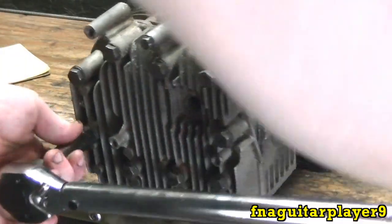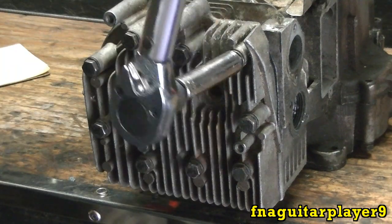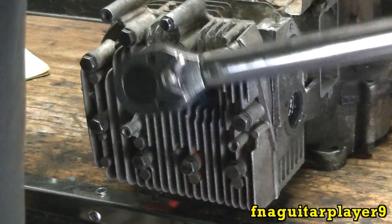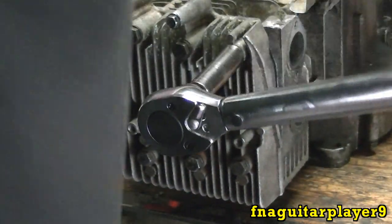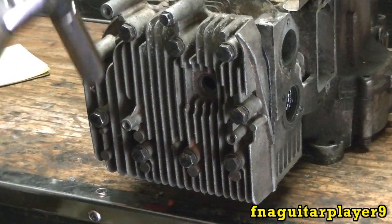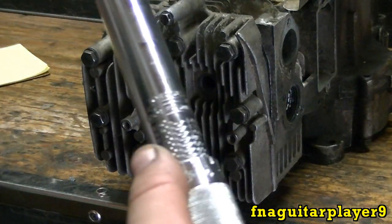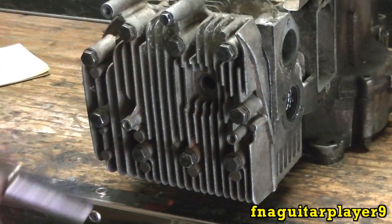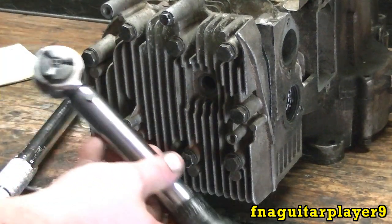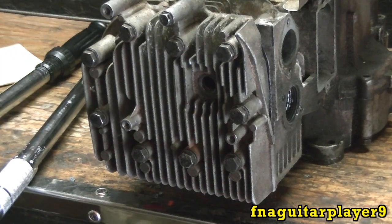This will be easier since you can get more leverage. There it was. This one doesn't make quite as loud a click as the other one because we're at such a low setting — if you get it up higher you'll hear it click better. Like I said, this is too big a torque wrench for something this small. All you need is a 3/8" or maybe even a 1/4" drive. The 3/8" is the most common click-type torque wrench.